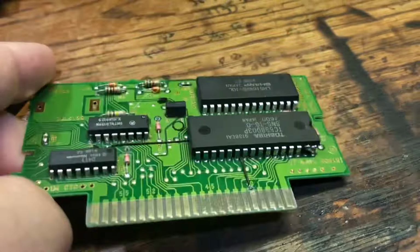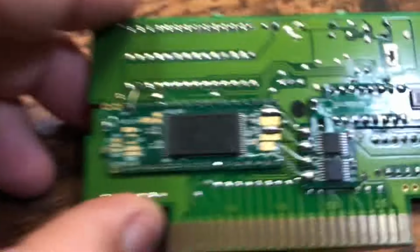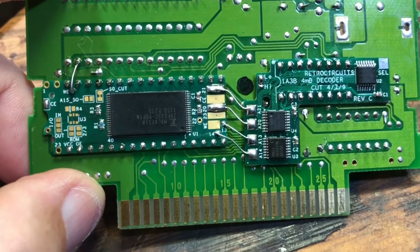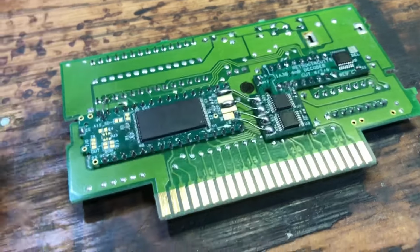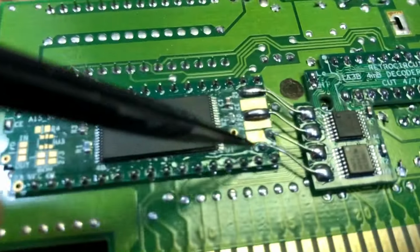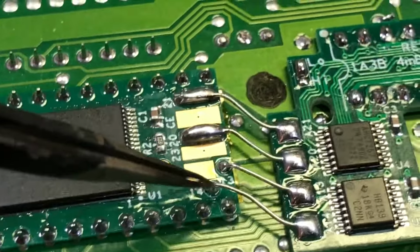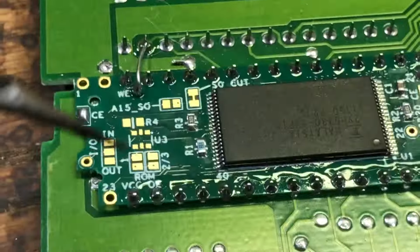So you've got to disable the ROM. You've got to run this jumper wire, and that's for both low and high map games. And then that. So you could use a different version of this. It would just be messier, but there's nothing going on here other than you have a ROM, and then you just have easy points to tap onto. There's no other logic chips on here.